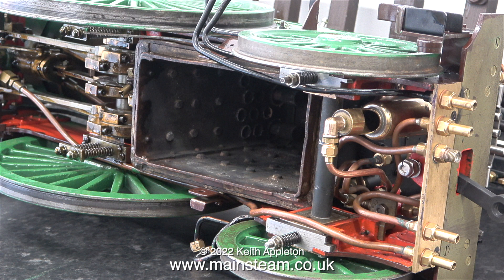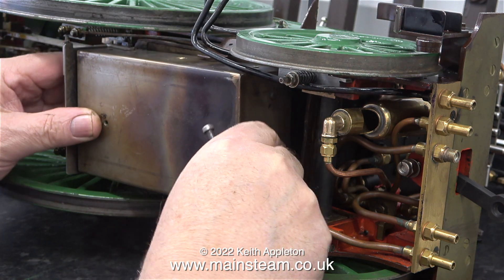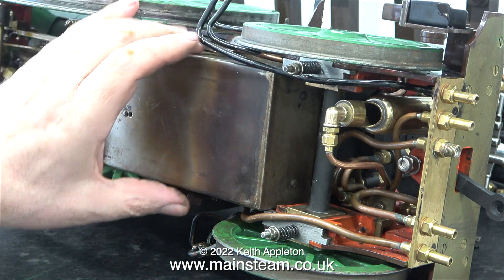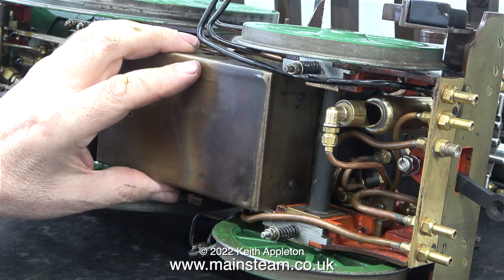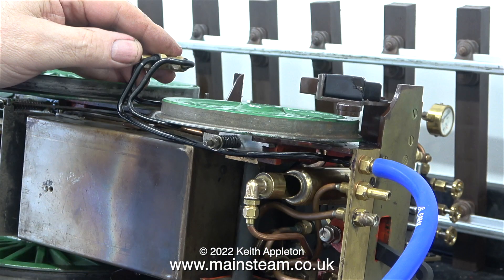Some of the connections are obvious — the bottom one feeds the water pump. But there is also another problem: the pipes are in the way of the ash pan. It's impossible to fit the ash pan unless I move some of the water pipes, particularly the one feeding the water pump at the bottom. I also need to move one of the injector water feed pipes away from the ash pan, because if the pipe is touching the ash pan, the pipe will get hot, the water inside it will get hot, and the injector won't work. I'm going to move the injector water inlet pipe to the other side of the spring, between the spring and the wheel.